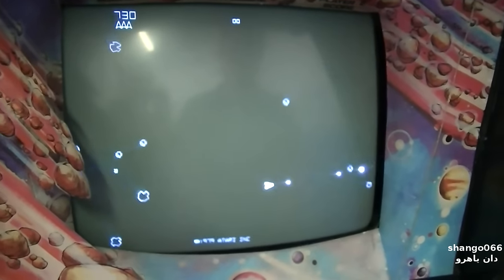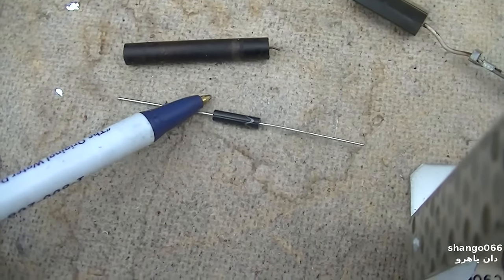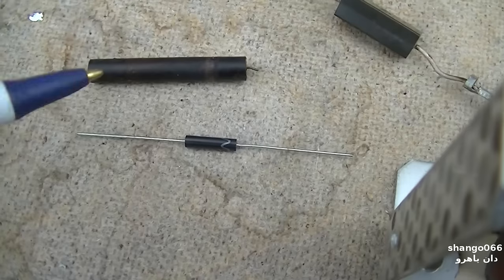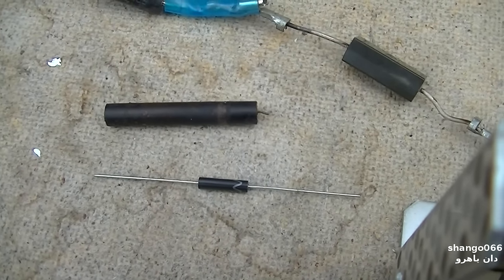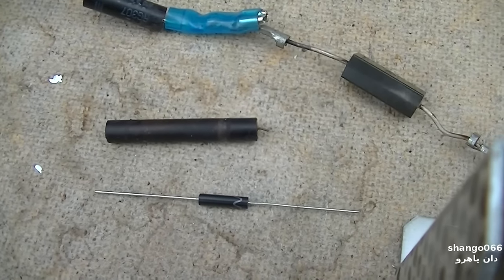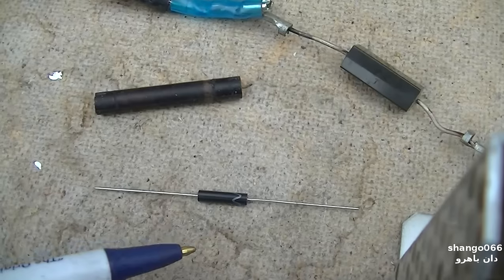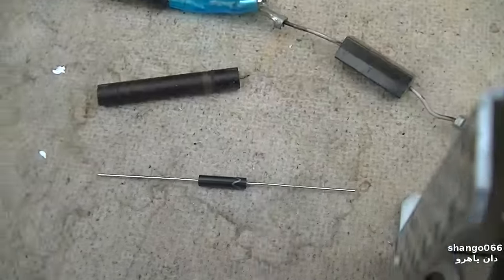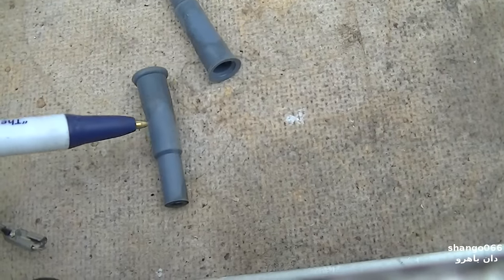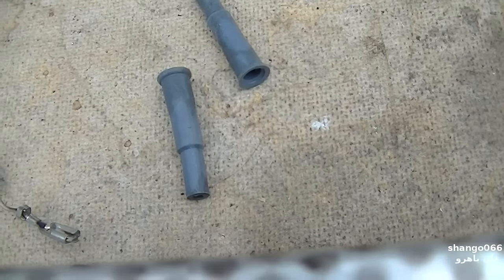I don't like this - it could be the high voltage. But hey, it's working again. Okay, this is the new diode I got off eBay. It's rated at 30 kilovolts at 5 milliamps, which should be more than enough for this - this thing is 15 kilovolts at maybe a milliamp. This is the original one - I can actually still get this. What I'm going to do is fit this in there, then slip one of these silicone high-voltage boots over it - out of a rear projection color set - and fill it with silicone.